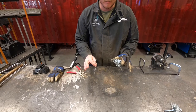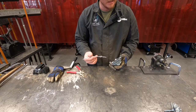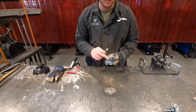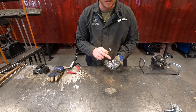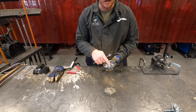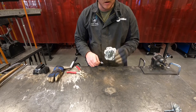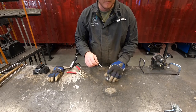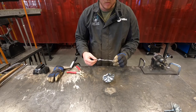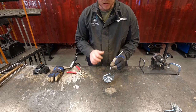Welding the stem on will just be done with small little tacks — nothing crazy. It's thin metal; it doesn't need it. This is galvanized coated sheet metal, but we're welding on the nut, which doesn't have any toxic coating. We never want to weld on galvanized coating. Since this is steel and it'll ground for us, just have the rose sit on its face and tack the barbed wire to that nut with some small tacks right there.